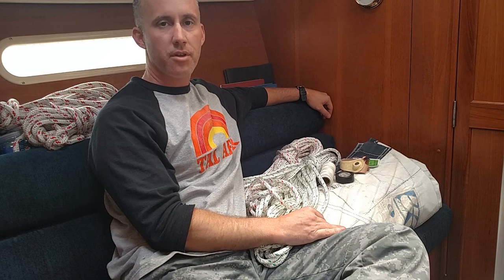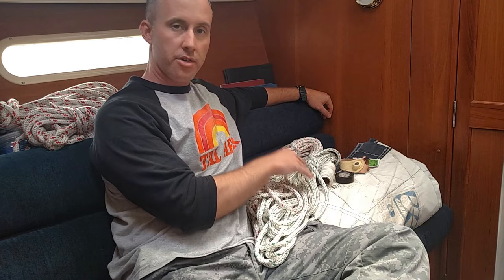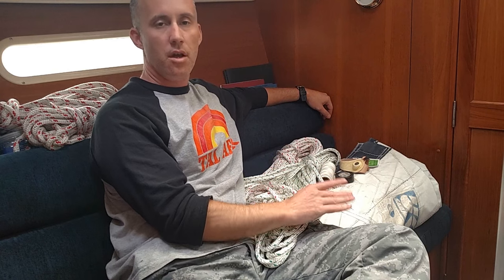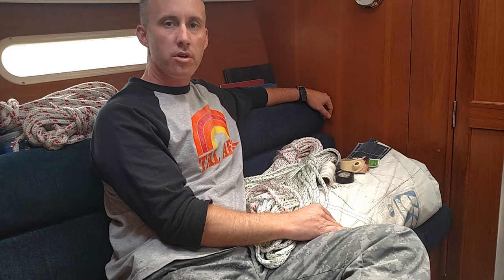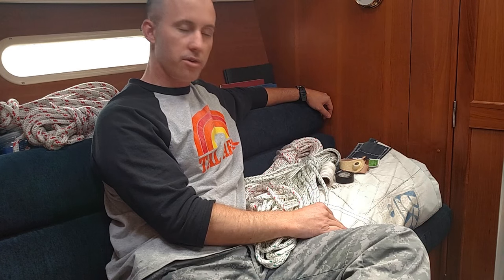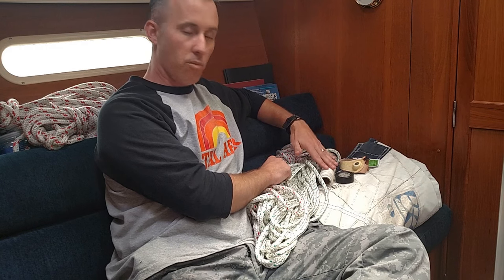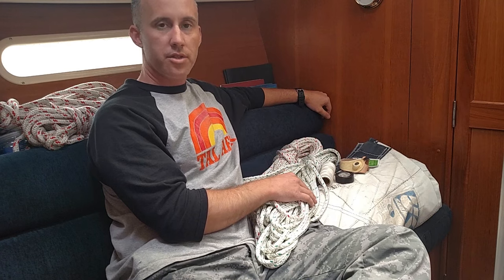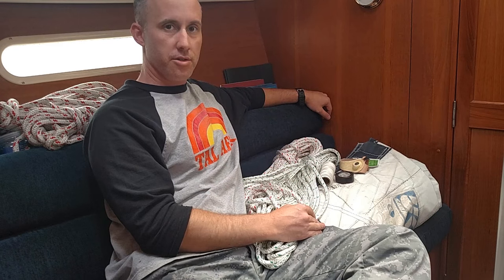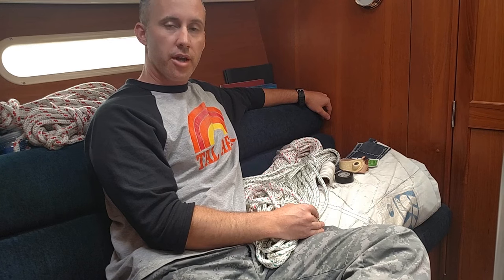Hello again viewers. As you remember from our last video, today we're going to go ahead and replace the main halyard and the jib halyard. We're also going to reinstall the sails. We took our sails to Hodges Street Sail Repair here in Oriental. They went over them, checked for any rips or tears, and made a few small repairs. The sails were in overall good condition, so we're going to keep those for another year or two. We also have out a sailor's palm, some needles, some wax string, and some electrical tape. We're going to use those items to attach the new halyards to the old halyards and run them through the rigging — that way it makes replacing them a whole lot easier. After we get the rigging reinstalled, we'll go ahead and reinstall the sails and show you how we go about that today.